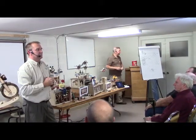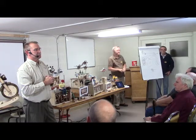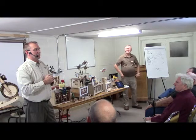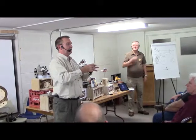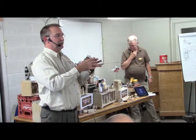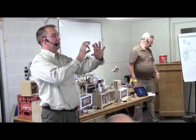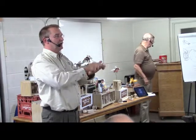Question in the back. Yep. Now I assume that at one point you wanted a dowel in the center. How do you find the center exactly using a center post? Just like I did that gear, I would go to my CAD drawing system, and I know not everybody does CAD. I draw a circle, and I don't care whether you do it on AutoCAD, Pages, or WordPerfect. You can draw a circle and then draw a small circle inside, put a crosshair in the middle of it, and I would print that out, glue it on, and use that.